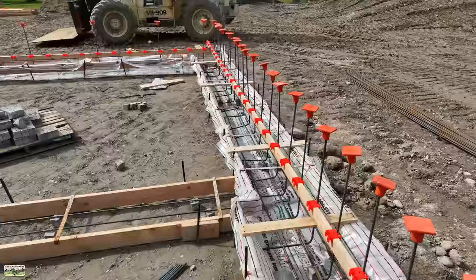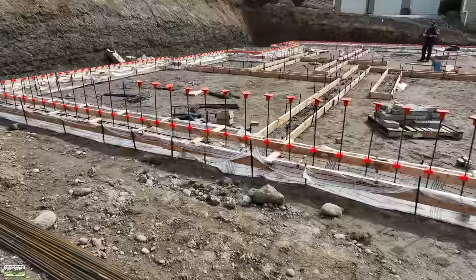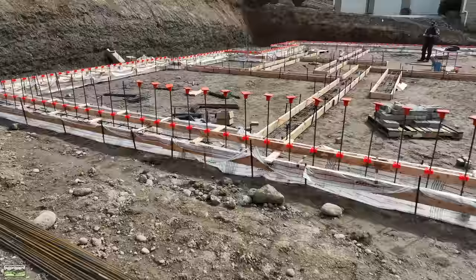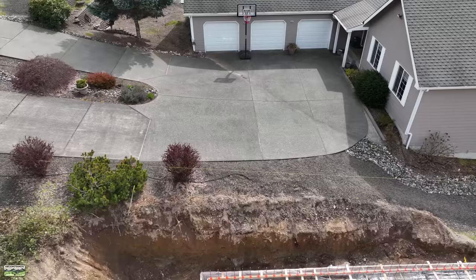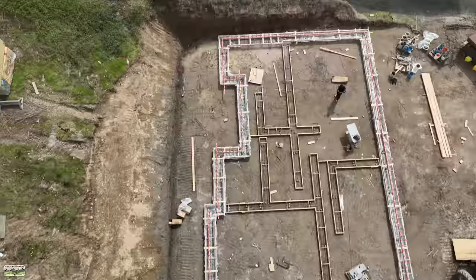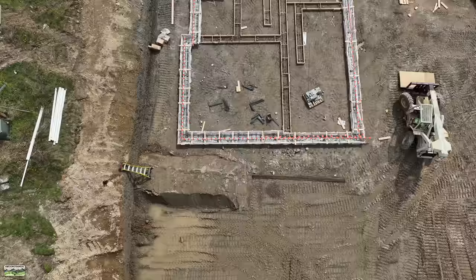Ten-inch on center is what our J-hooks are. Most of them had 12-inch tails - that's the hook underneath the horizontal in the footing. That run you just saw, I think they were 18 inches. The back wall, being two feet, the engineer just had us put them on four-foot centers - man, do they fly installing at four-foot centers. Most of it was 12-inch centers but all of the front wall was 10-inch. It was a lot to do - not a huge footprint, you know, 64 by 40 - but a ton of steel. It's done.